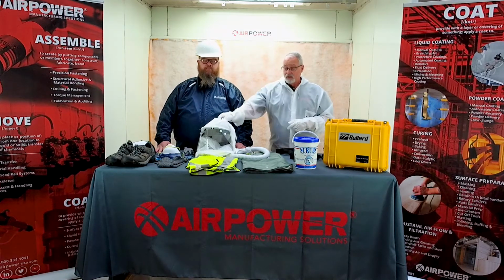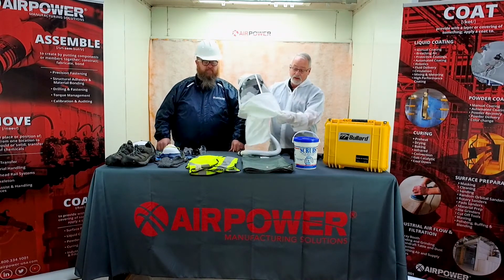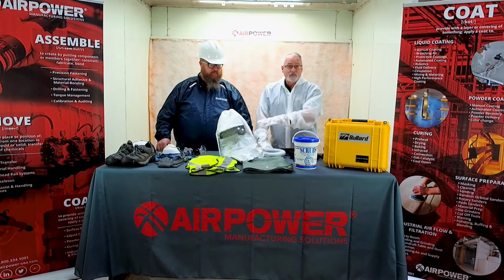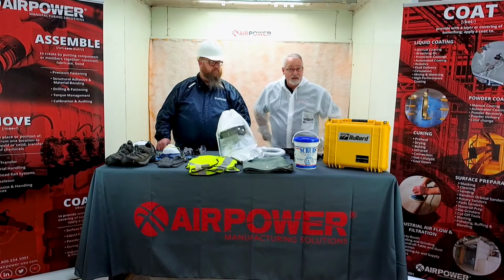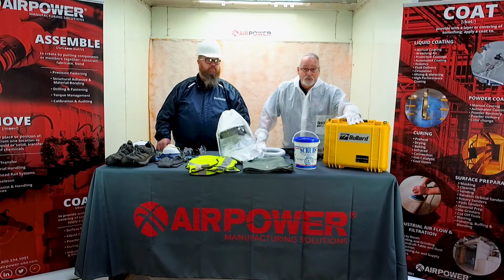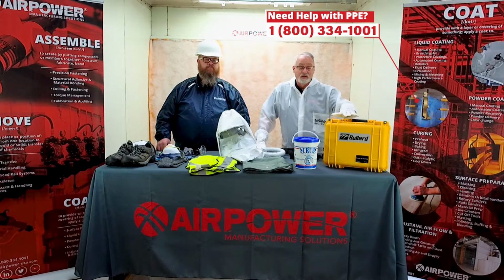But for Travis, you're going to have to get into a hood, that we showed you at the beginning of the video, that has a bib in the front and a bib in the back that tucks down in your suit. That is maximum protection for you. When you use this, it can be through a battery powered pack on the back that filters through HEPA filtration, very high filtration, or you can do it through a grade D breathable air system that uses your compressed air or a free air pump outside of the spray area to bring you fresh grade D breathable air. It has 3 stages of filtration in it.